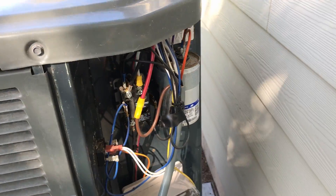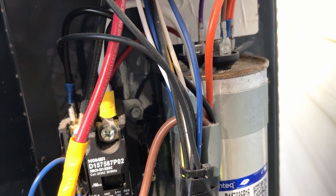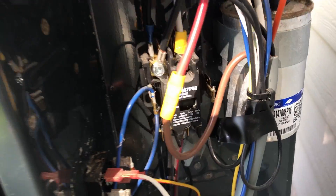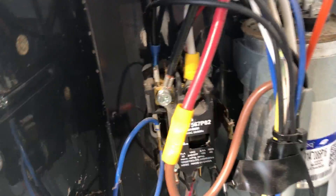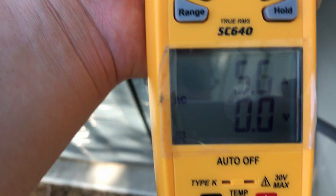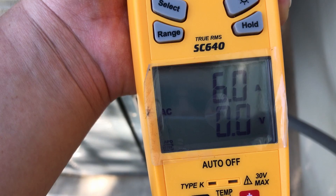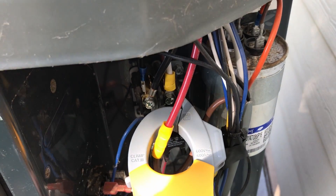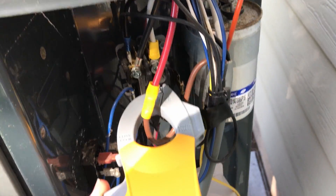Let's come up here now. We've got a couple different wires coming out of this cord that goes to the Easy Start. Let's just clamp them and see what we've got. We've got this brown wire that's tied into the red, which I believe is the start winding. So 6.0, 6.1 on the money coming out there on the brown wire tied into the red.